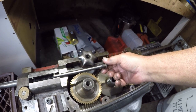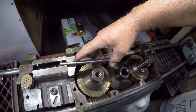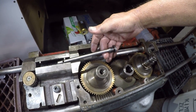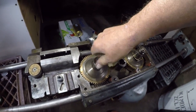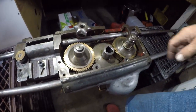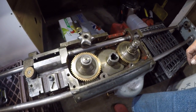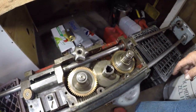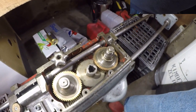Other than making the adjustment on this clutch and looking at that oil line, that's about all we can do to the apron. This journal down here should probably be five to ten thousandths larger than it is — I had to turn it down just to clean it up. I've had vise grips on it trying to free this thing up before I got it off the machine. It's not perfectly straight but it's running pretty true. I also need to flip this thing over to see the oil pump.